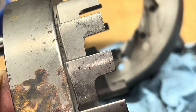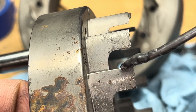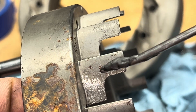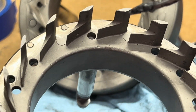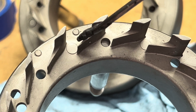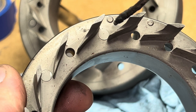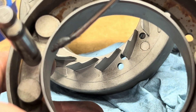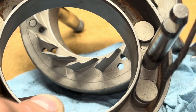Some other things with these that can happen is when they start sticking, you get some mushrooming back here. A lot of times that can be filed down so it'll go back in and start working properly. The next thing to check for — you have these two pins right here. Make sure those are there, and check your other side because you've got two more right there. Now we'll flip it back over, and the two pins run to this and this, and the opposite side here — this one and that one.